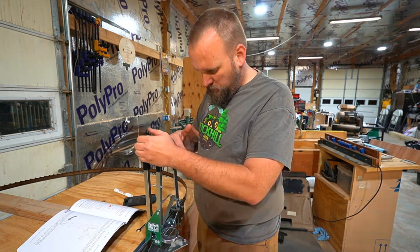Okay, so I've been all the way around the blade. Now I lift this out, lift it up, slide it off, rotate it, slide it back over the other side of that same stud, drop it back down, and the settings should be the same. But now I need to move forward two teeth to one that is offset in that direction and set us up here. Now when we go one, two, three, we're once again on a tooth set in that direction.